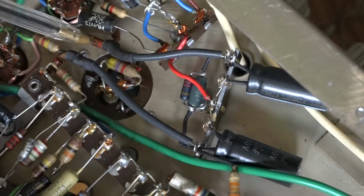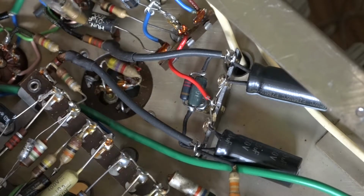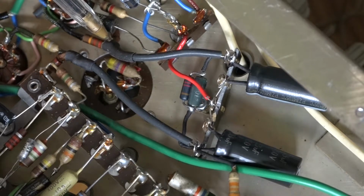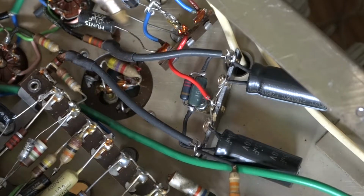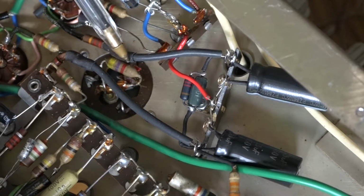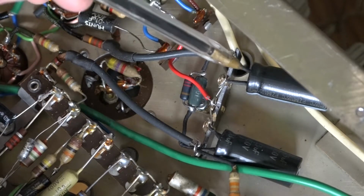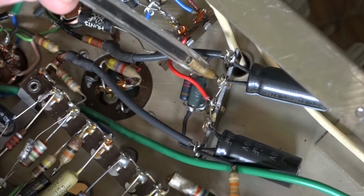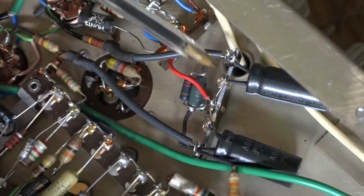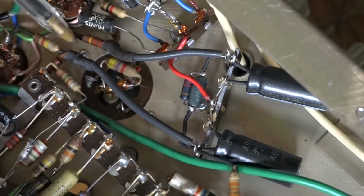These two resistors here went to this side of the capacitor, so I've joined them together, and I then also joined them with a piece of tin copper wire. I then added this piece of rubber sleeving, and I then put some heat shrink over the top, so that is all completely covered. That's then soldered to the plus side of this capacitor. The ground of this capacitor is on this grounding line here. This is the ground that went to the capacitor, which I've wired to here.